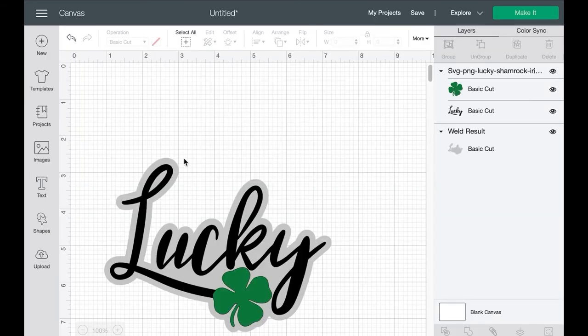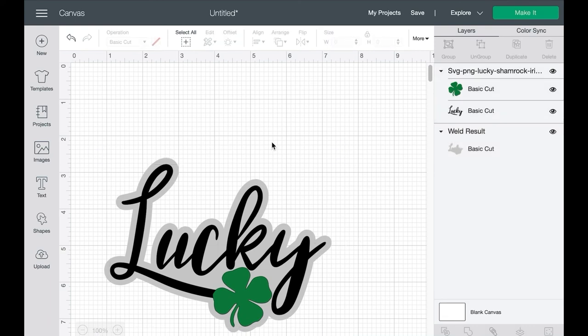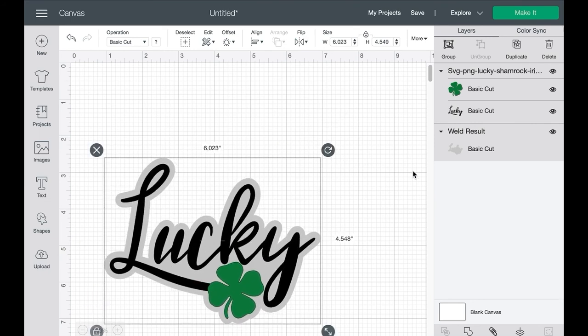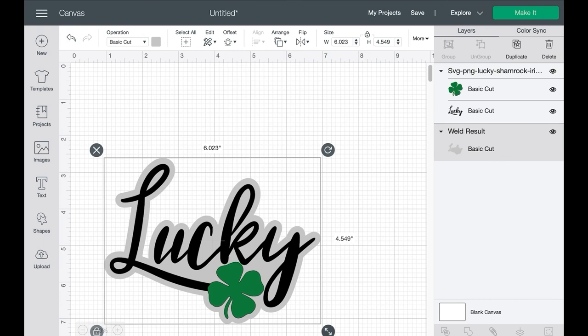I used to cut wood using my scroll saw, so I created the background and also just made them as print templates to put on the wood. One thing to be sure of: when you're creating your offset for the background, you want to make sure your design is pretty much final. Otherwise, you need to select everything together if you want to resize or rotate anything so everything stays together. If you were to only select the offset, you would only be resizing that, which would make it challenging to match back up perfectly.